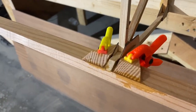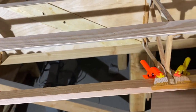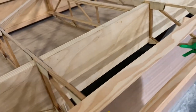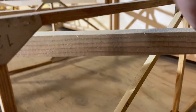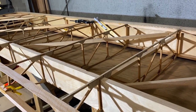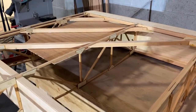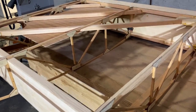I've got all these clamped in place — epoxied and clamped — and they're cut to the angle that I had to sand the other wing to, which is phenomenal; I don't have to sand that. When I flip the wing over, I've already got these sanded with my little curve in them, all ready to attach to the other side. I'll also come in and add these little triangle pieces that go between the drag brace and the bottom of the rib. This is going great, and at the same time when I flip the wing over again I'll be working on the rest of the fuel tank area, just like the other wing — get all those components put together and ready to move forward.